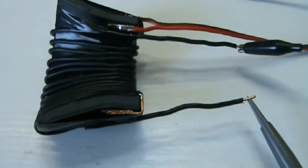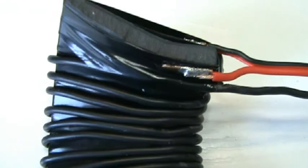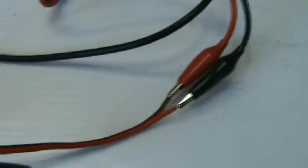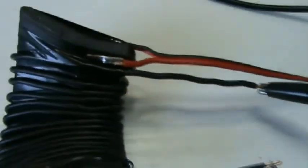Okay. Welcome back. I have now put my first coil around the yoke. It's the 15 turns. I have the copper strip connected with a cable. I have the bridge on the other side, and I have now hooked up a coil, 50 turns. It's wire 1 millimeter thick, AWG 15 I think. And I made some measurements on the lot, and first the data on the copper strip. It's about 1/3 of the height of the yoke. It was measured 10 picofarad when not connected to each other. And I have 5 microhenry when connected with the bridge. So that's the data on my copper strip.